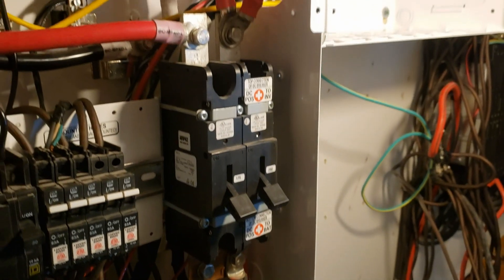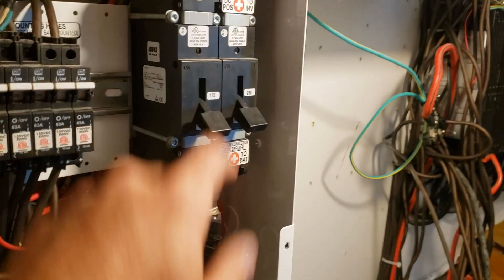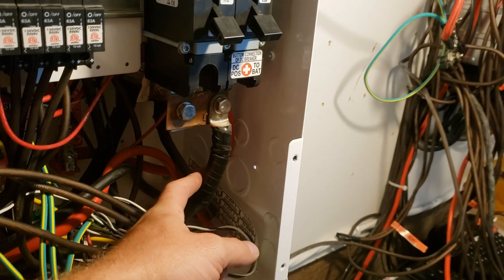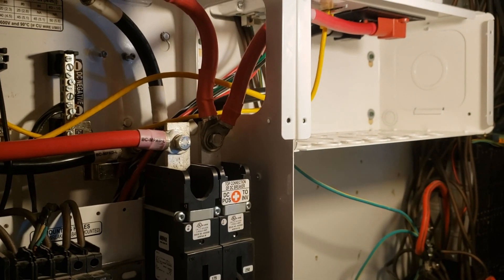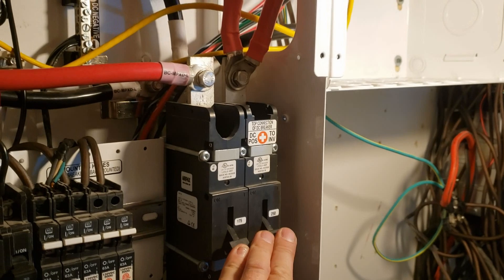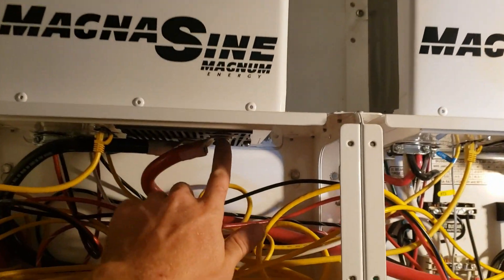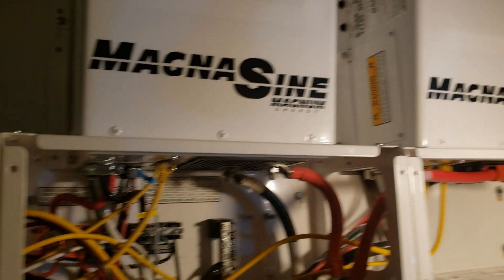I don't think I'm gonna have a problem. So we're gonna try this — you can see I just connected to it here. I also made myself a bus bar to just go across at the bottom, and then I have my three-aught cable. The only thing now is I've gotta do the math and see if my three-aught cable is adequate or not, because this is now going to be able to pull a ton of power. I still have to put some covers on here, but other than that we're almost ready to close up.